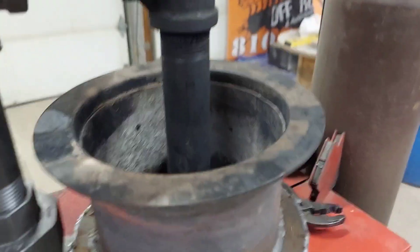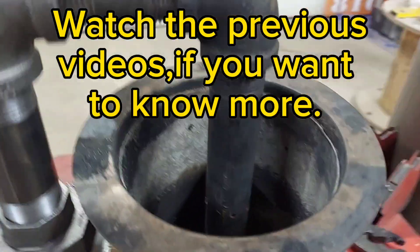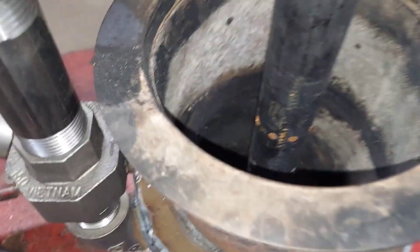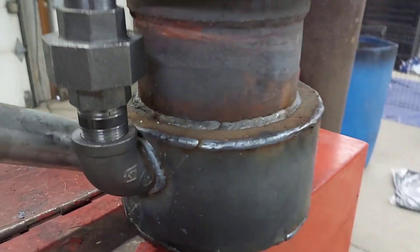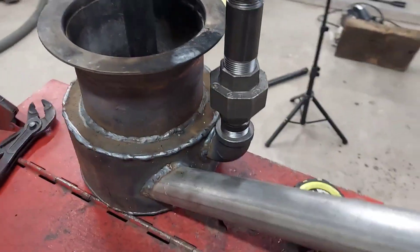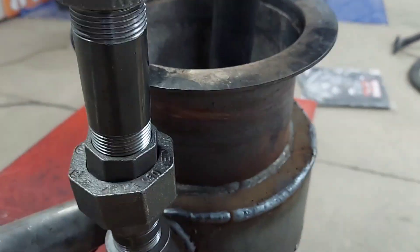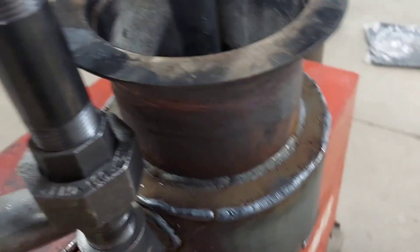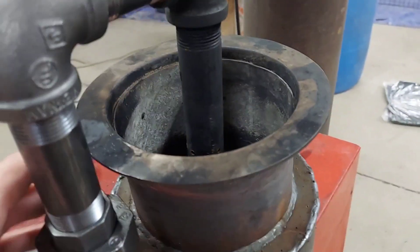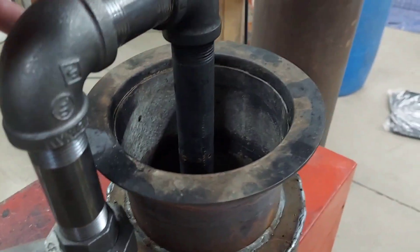It's all made out of the one inch pipe from the no-weld burner, but this one I had to do some welding. This flap I ended up closing and welding it shut — I'd been testing off camera since I made that last video and I just couldn't get this thing to light. It would light but it'd take forever to get rolling, and I need it to light quicker and easier. I use the union here so we can take it apart to pull the nozzle right out of there and clean the chamber, because inevitably it's going to need to be cleaned. I just wanted to make it able to come apart so we could get that whole assembly out, knock it out, get it cleaned, and put it back in.